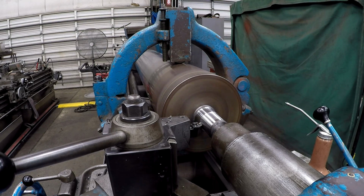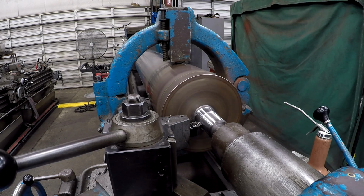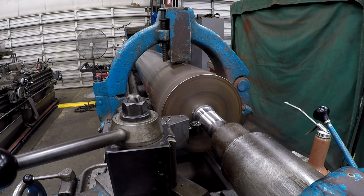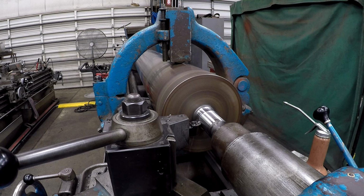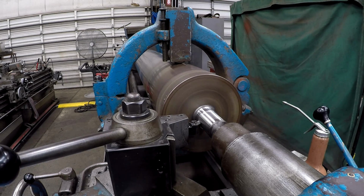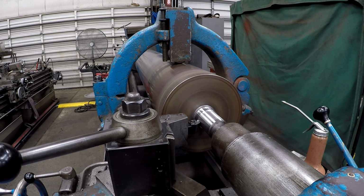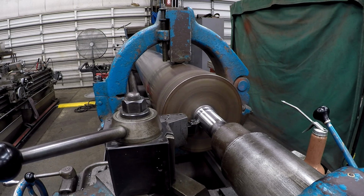Taking a second rough pass now, with the big radius coming into that. I use some big radius tool, probably 1/2 inch. Go in there and clean that corner all the way up. Make it nice and round.